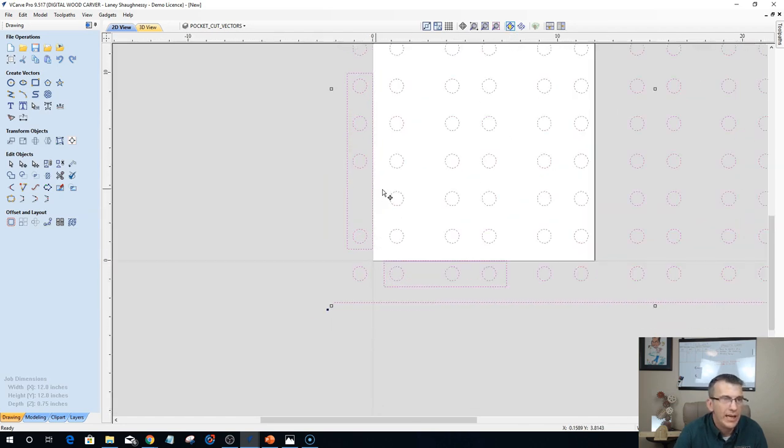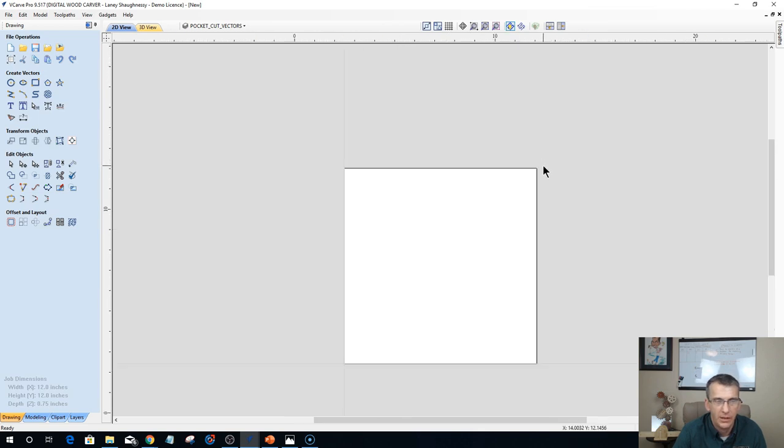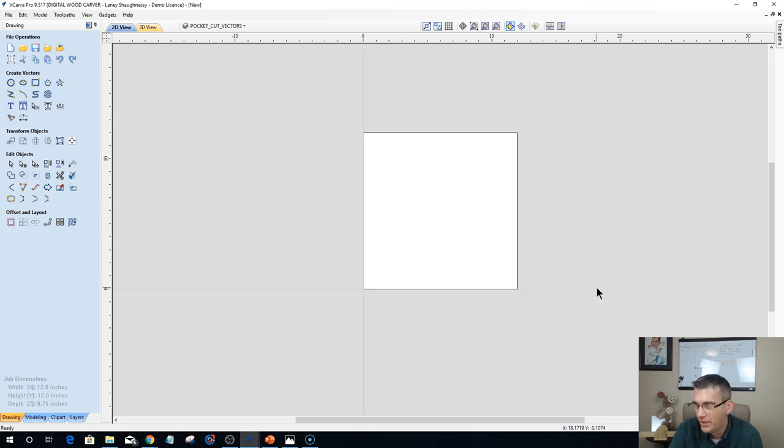You know, and now I know where my holes are laid out, and it can tell me where to put my wasteboard holes. When I'm done with that, or my alignment holes, I can just delete that file out of my project. So I always have a layout. So I never run into an issue where my holes fall into the bigger holes.